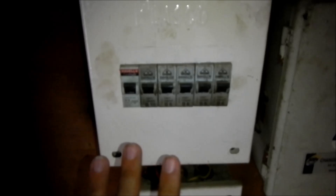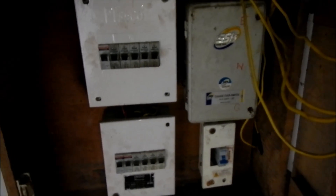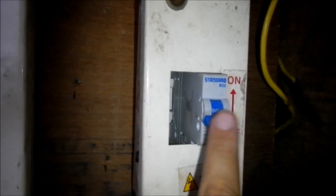They have pretty light loads — just fans and some lighting. When this switch is in the on position, grid power is being supplied to the school and there'll be a flashing light on the LED indicating calibrate. If I switch this from the on position to off, grid power should be off now and we should be running the school on solar power. We'll see the LED stops blinking.